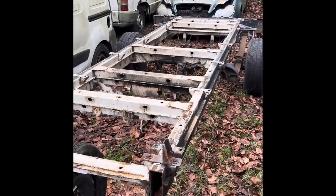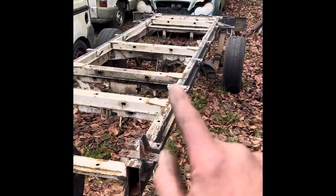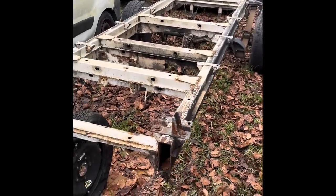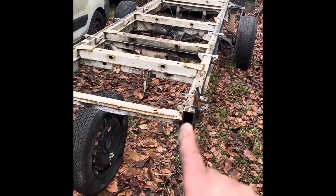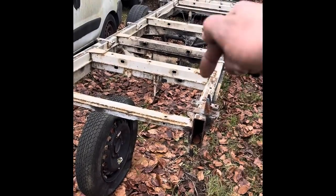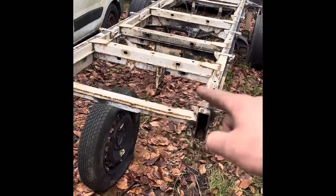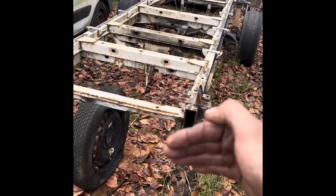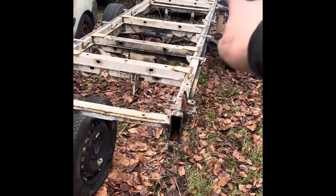So you can see where I'm coming from. Basically, I can do some wax wiping and some sorting and end up with a rot-free truck. Yes, admittedly chopping it in half. Structurally, maybe, but in theory, if I reinforce these shunt rails into the cab, because I've got a Hiab cradle sat on here, plug it, weld it, bolt it, then it's stronger than it is on the join between the cab and the truck where the Hiab cradle sits. And if it's going to snap in half, it'll do it somewhere back there where it was original.